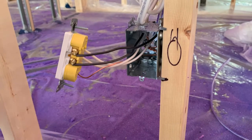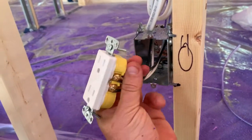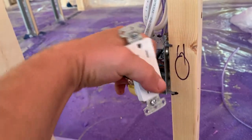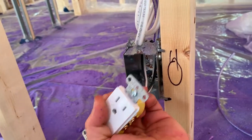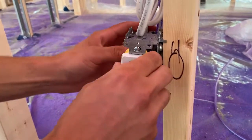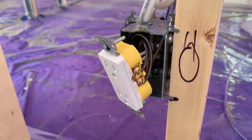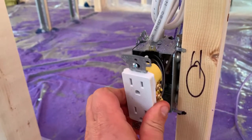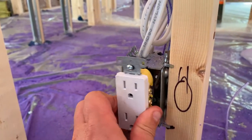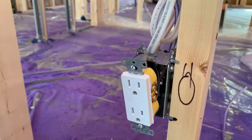Now one of the most important features: when we roll this wire into the box, we push them together and roll the wire up around and stick it onto the box to screw it on. The reason we roll that around is to stick the excess wire in behind the box, getting the wires right in behind. Then if the drywall were on, we'd just screw the plug on, put the plate on, and we're done.